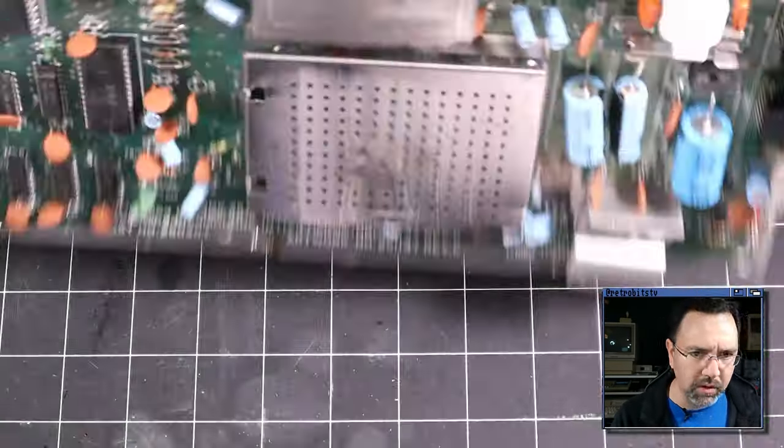All right, in our diagram, our data lines on the CPU are here, and they are on pin 37, counting down from D0 to pin 30, so on D7. So let's check those first. All right, so the CPU is a 40-pin package, so we've got pin 40, 39, 38, and 37 right here. Let me flip the power switch.